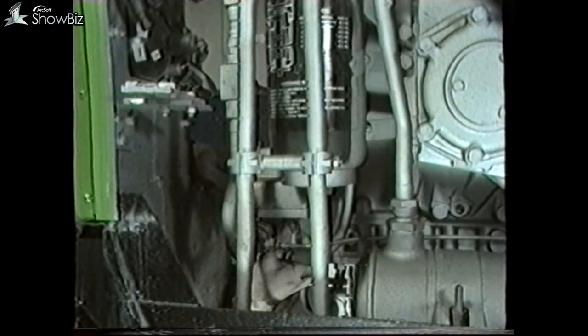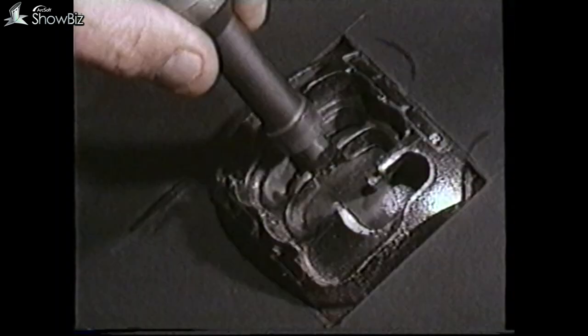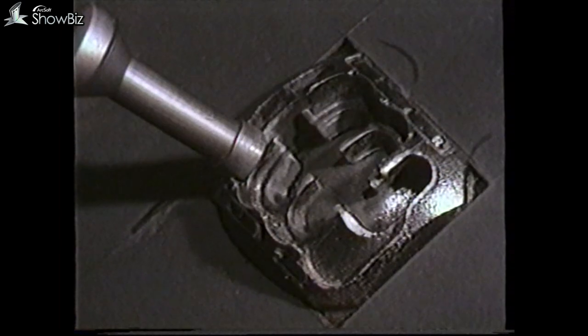So the first stage is to check whether the control panel light is on. If the light is on, then the panel may be indicating a two-gear situation. To eliminate the solenoids and wiring in the EH block, disconnect the cable plug on the EH block, and having completed this, take the controls through the start sequence. If the light goes off, your fault is in the solenoids or their internal wiring.